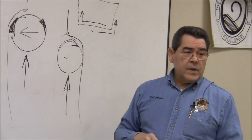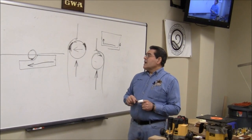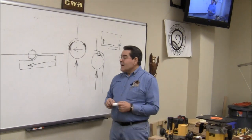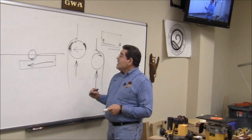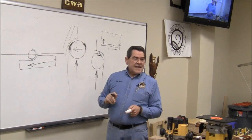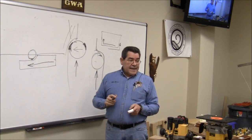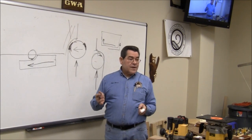The problem with using a router is it only spins in one direction, so you can't reverse your direction like a chisel or a plane. Sometimes you can flip the wood and that will help. But ideally, if you're always working with the grain and cleanly cutting it — if the grain runs the other way, it's going to tend to splinter. About the only thing you can do is take a shallower cut, because you can't always reverse the piece, particularly if you're using contour bits.